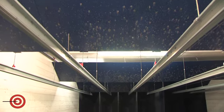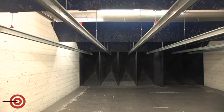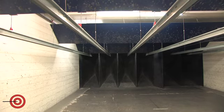So it makes for safety, but it also lowers your costs as a range owner. You don't have to totally cover and encapsulate your whole roof with steel. The ceiling plates are laid out where if you're shooting from the firing line, then your ceiling is safe. Your light fixtures are protected. Your HVAC ductwork is protected. Even in this range here, you can see they have a fire sprinkler system that's protected. So that's the layout of the ceiling plates.